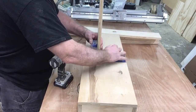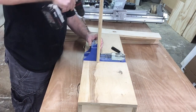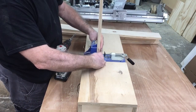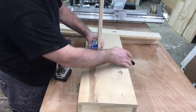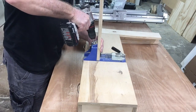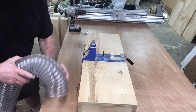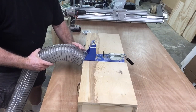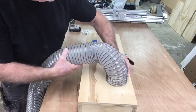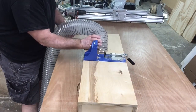Now that the legs are finished, I'm taking the cross members that support between the different legs and I'm using pocket hole screws. I could use a number of different types of joinery, but I'm choosing to use the pocket holes because it's so fast, easy, and works extremely well. I said this was going to be a very simple and easy to build table. After I cut all the holes I do vacuum up the sawdust — I've had people ask about how the shop stays clean, and yes, I vacuum all the time. That's one of the really nice things about having the central vacuum system.